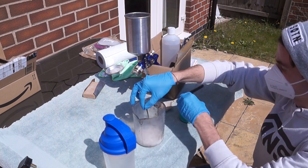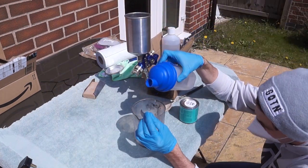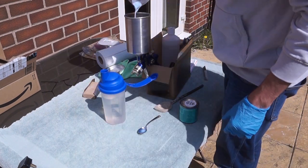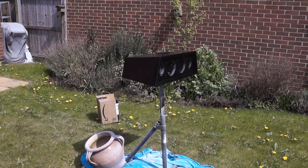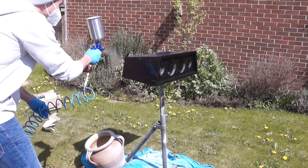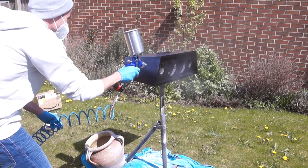And with polycrylic, you can lay down multiple coats in quick succession. So I did four coats here with about 15 minutes space between them. And the reason you want to put so much on is because you're going to sand a lot of this back to get it flush before buffing it up. And that's how you end up with that mirror finish.